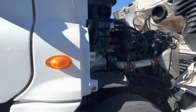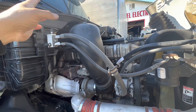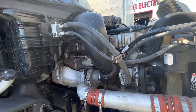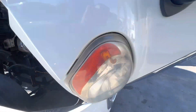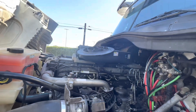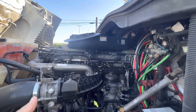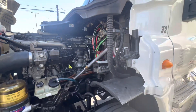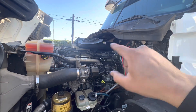The manual is going to tell you to check your overhead. Number one — the truck is right about 600,000 miles. Number two is a software update. The easiest thing I can do while waiting is a valve adjustment — I know you guys hear me mention that a lot, but it makes a difference. It makes the engine run smoother with valves opening and closing correctly. We'll double-check the valve lash on intake and exhaust. If it's good, we should be getting the one box back tomorrow, put it together, do a regen, and be ready to go.